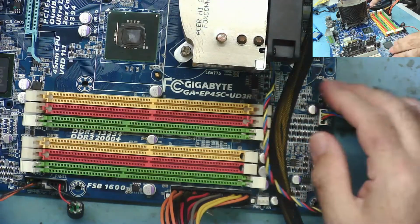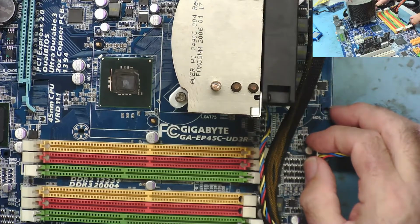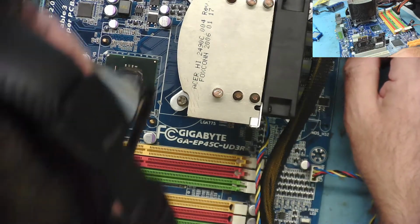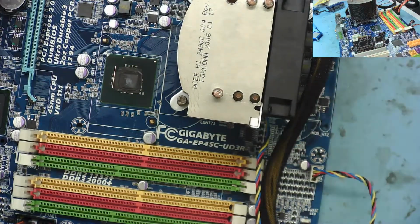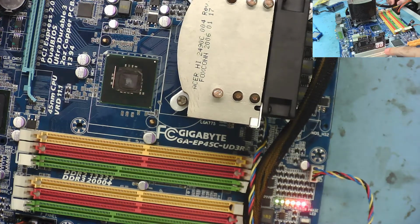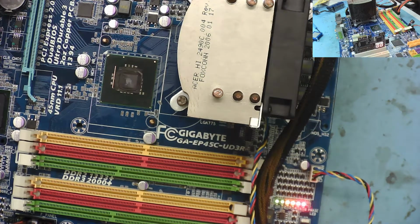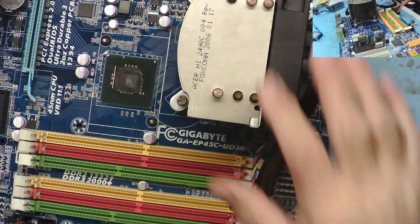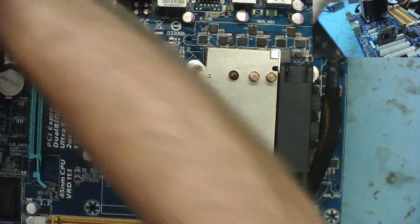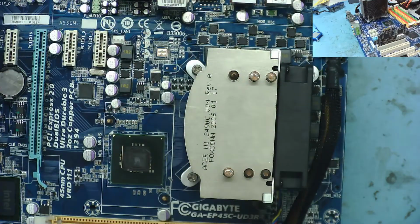This is acting very strangely. The speaker's connected. Yeah. The wires fell off it. Well, we've stopped it bleeping, guys. That's rather bizarre. Power on. Fan isn't spinning. These LEDs are lit. This is now on 0, 0, whereas before I think it went C1 when it bleeps. We've broken something. So let's have a look at what's on Vcore. What have I got on Vcore? Something's changed again, obviously.